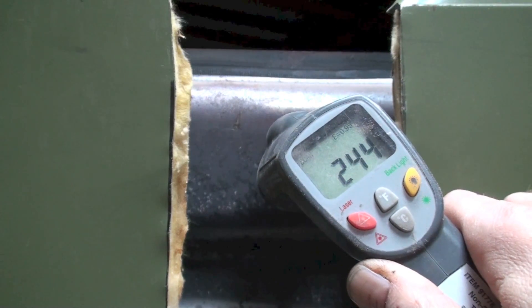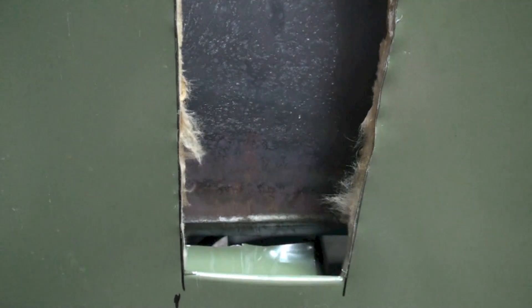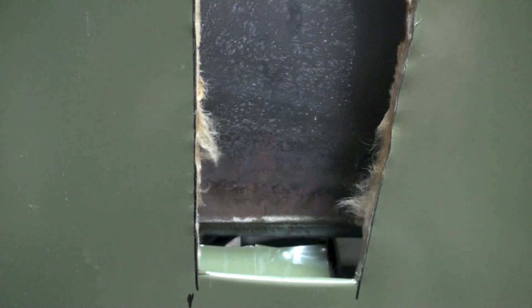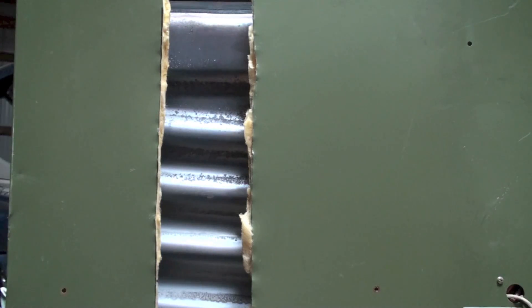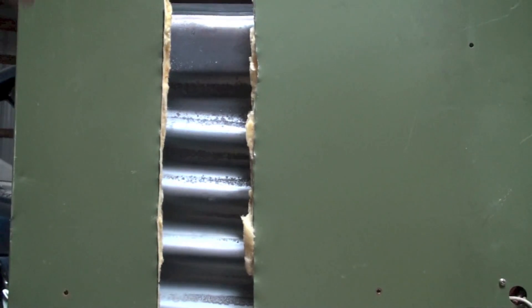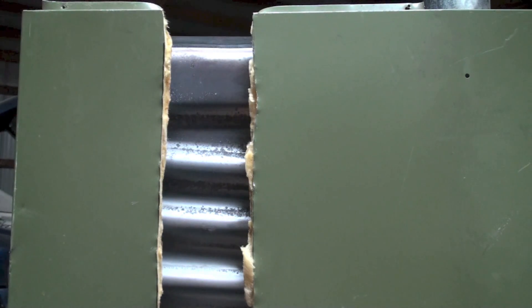So those are the different temperatures as you go through this heat exchanger. Down below, that's actually below the burners, so it wasn't very hot. The gas was still burning there and still producing heat. Remember, we're at 800 on the bottom and we're at about 300 on the top. So as we went up, there was a considerable drop - three indentations and more or less 100 degrees per drop, plus that last one up there that dropped it quite a bit.